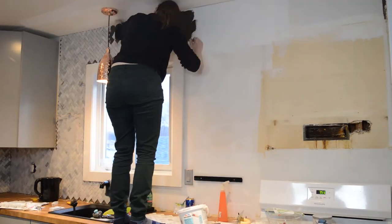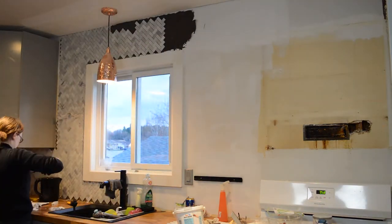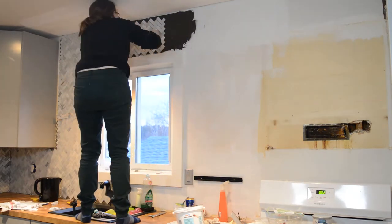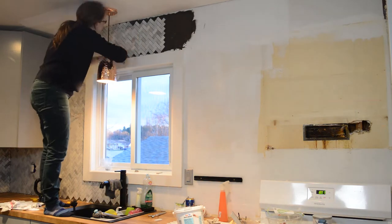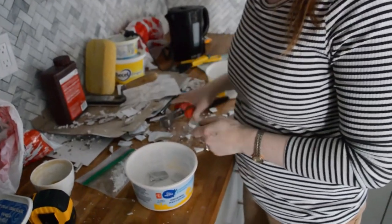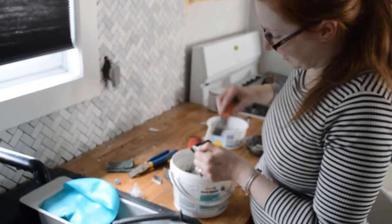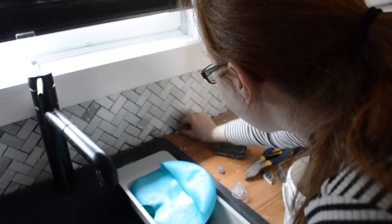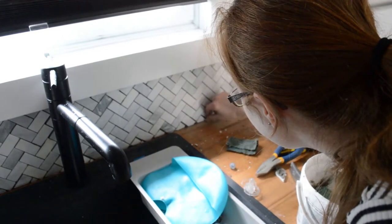I continued moving forward doing as many full sheets or full pieces as possible and left all of the small tiny cuts for afterwards. It was quicker to go this way rather than trying to cut perfect lines as we went. When you go back in to do the small tiles, you can cut them individually on your wet saw, or sometimes use a snipper tool if you just have a little corner to cut off. You're also going to need to back butter your tiles — meaning putting the thinset directly on the back of them and sticking them on the wall. Make sure that no thinset squishes out; if it does, use a spacer or butter knife to get it out.